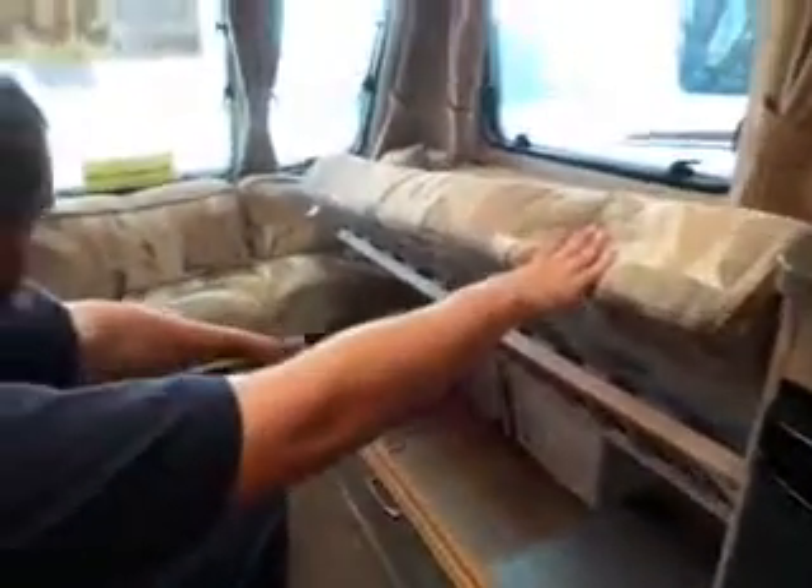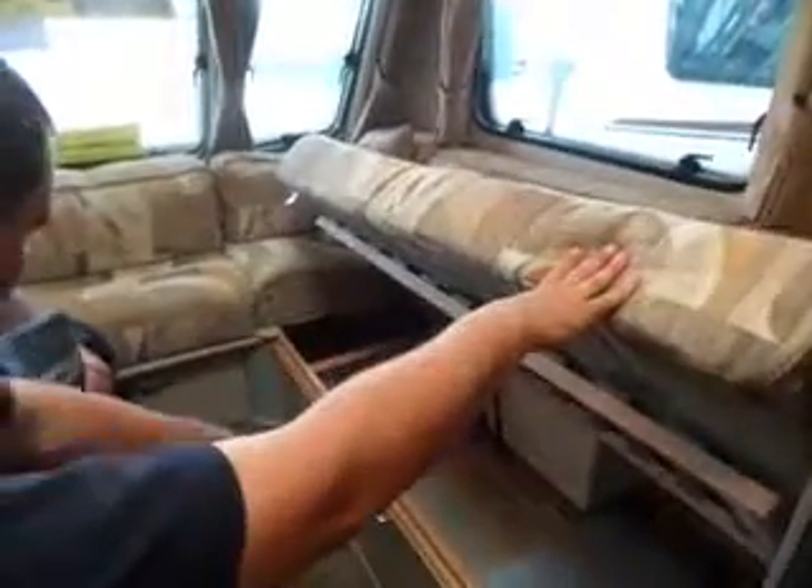In the corner over there is your water boiler - that's your water boiling system. You can see the blue pipe that comes off it with the little yellow tap that's sitting flat. That's your drainage system to drain off the water in bad weather. So when it comes to winter or October time when it starts freezing, all you simply do is lift that yellow lever up so it sits up straight. That will automatically drain that tank out. Then all you need to do is come to your taps, open your taps up and just get the last residual water out. And that's it - once there's no water coming through your taps, just leave that tap up and your system's drained off and you're set ready for winter.